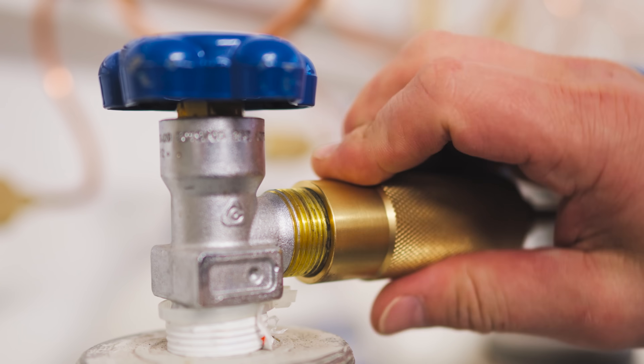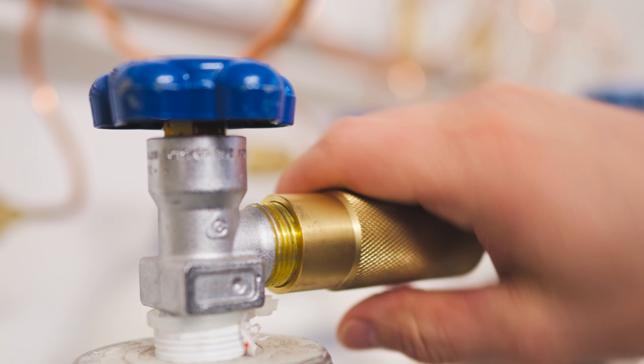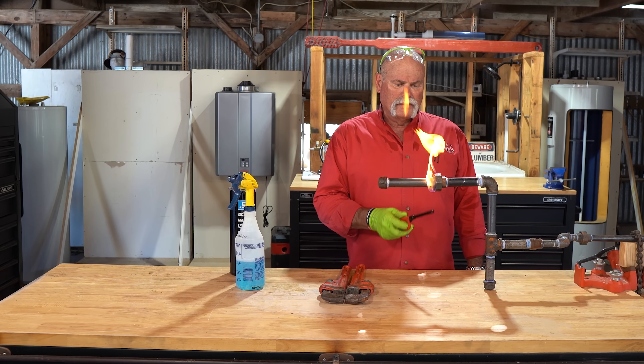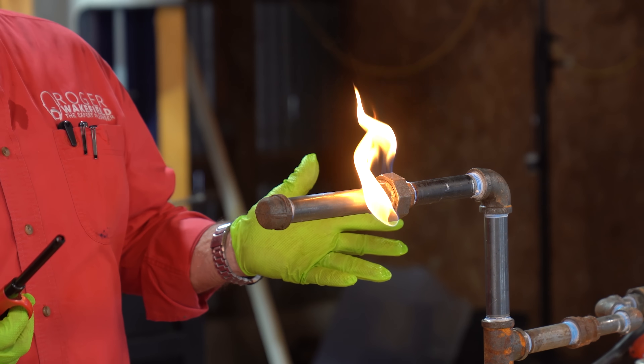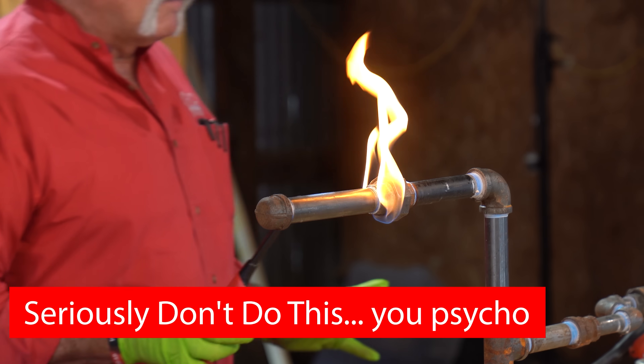Gas is a very low-pressure system. Here where I'm located, the gas system is actually two ounces of pressure. So when we test it to 15 PSI, that's really not a big deal. If I can install water lines and make them not leak, I can do the same with gas. But remember, when you're doing that soap and water test, never use a flame. I've had some old plumbers say they just run a flame along it — if it lights up, they know where the leak is. I'm not that crazy.